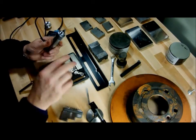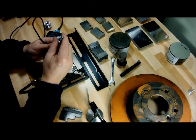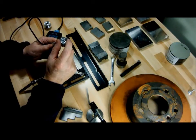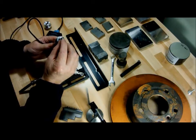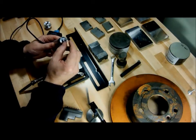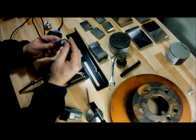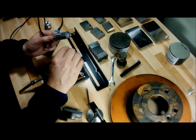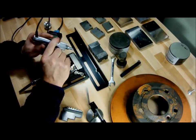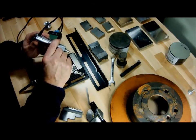One of the big differences between the ultrasonic and the rebound type is that we don't use a carbide ball — this is a Vickers diamond. Inside there is a rod that the diamond is attached to, and it resonates at a very, very high frequency. When it's applied to the part, we're measuring the resistance to the frequency and getting a very accurate reading.